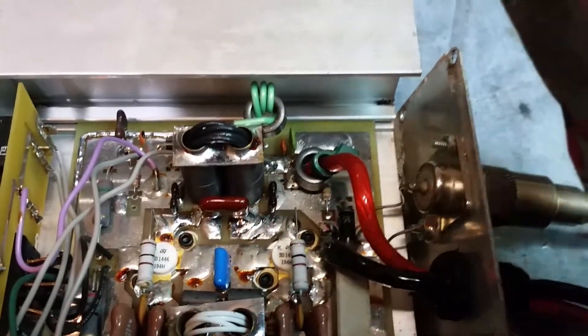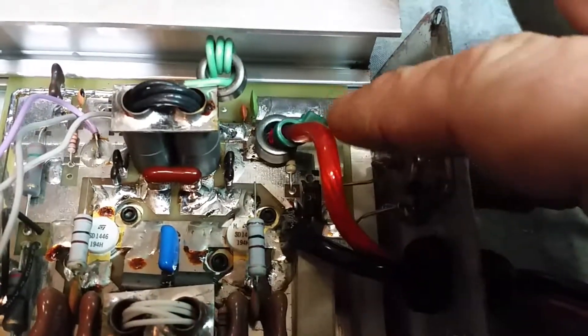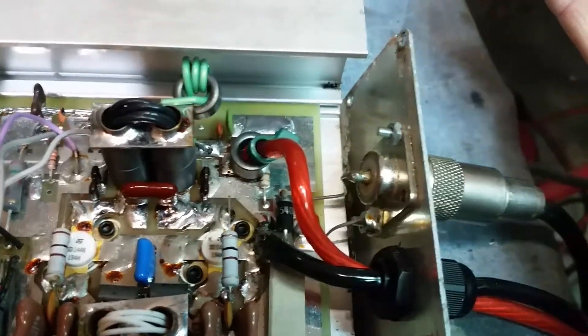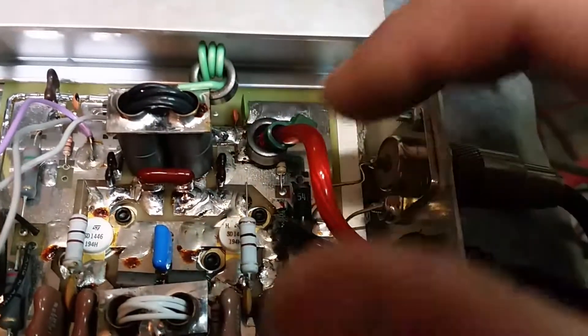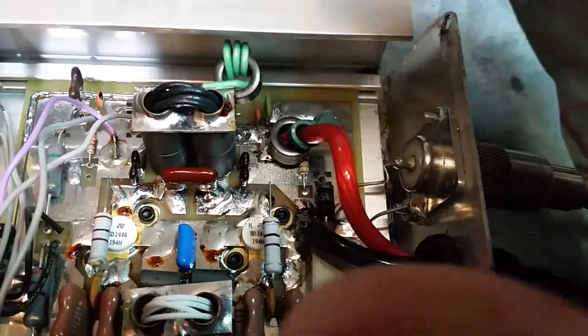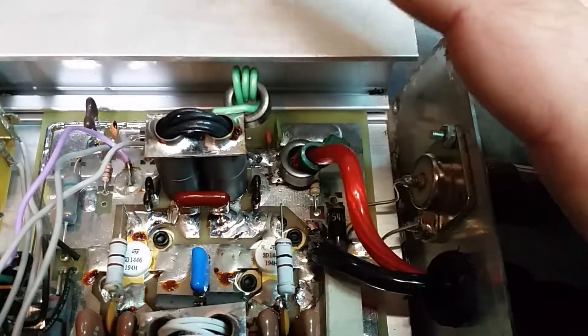You want to keep it around 500 ohms to the lowest frequency you'll be using — there's a formula for that which I did not have stored in my hard drive. So I went ahead and added a ferrite bead to the power wire plus three wraps right here on the output transformer. I also added some filter capacitance on the hot bus down here, because all it had was a 4.7 microfarad electrolytic. For frequency filtering reasons I went ahead and added a 104 — a 100,000 picofarad cap down there on the hot bus too. It's always good to have one.